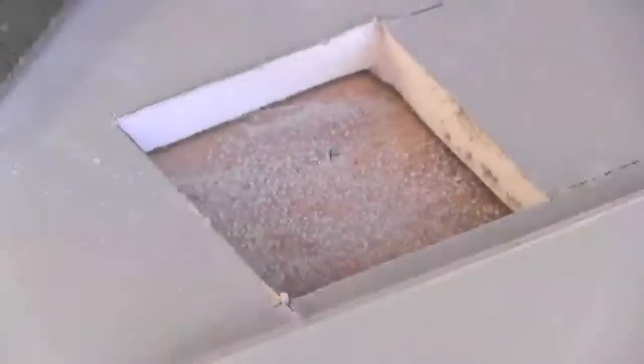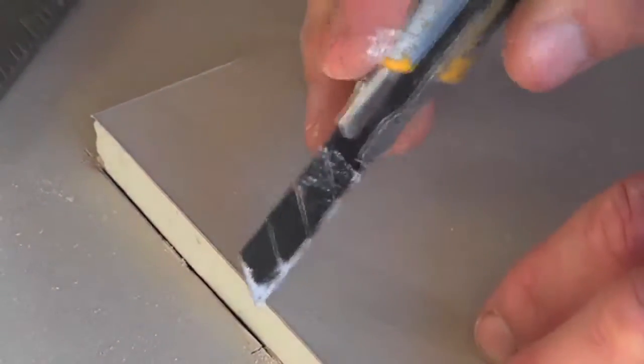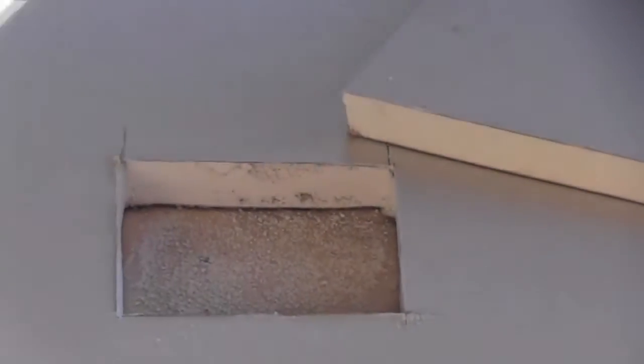So we'll transfer the measurements over here. Or quite simply, you can take the piece of drywall, square it up, look at the mark if you can't measure, and just take your knife, make a little tick, then slide the piece across, make another tick here. As long as this piece is square, you take your speed square and you simply score it down.